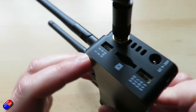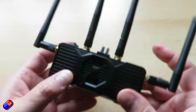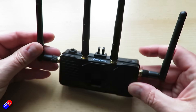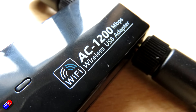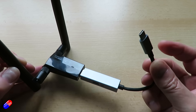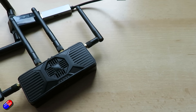This module is doing an awful lot of the hard work in terms of decompression and other processing, as well as pumping out a standard HDMI connection. That makes this so much easier now — anything with an HDMI input, including FPV goggles, you can just plug it in. And there's also a standalone receiver you can plug into a tablet and use an application to view video live, though you'll need a pretty high-end tablet since all that decompression has to be done via the tablet CPU. This kit feels like a real product rather than some of the earlier attempts.